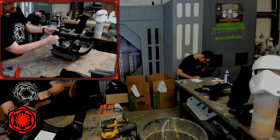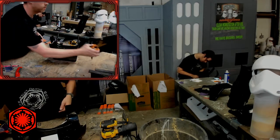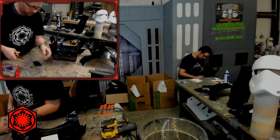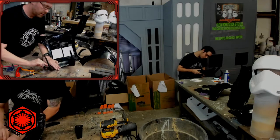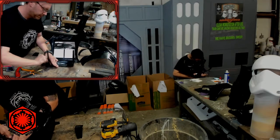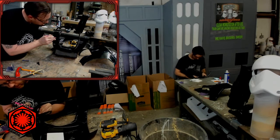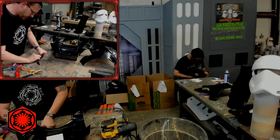So we want to cover the inside here coming down. We're not going to use the whole thing. For building these tabs right here, let me cut this 90 degrees. We only need about this much. And this is just some really good handy plastic to keep around in your scrap bin. We got tons of it. Same as always. Sand anything that's going to get glued together. Not gluing this yet. I want to make a little pencil mark so I have a guide to follow. There we go. I have my little line here, and I'll sand up to that line.